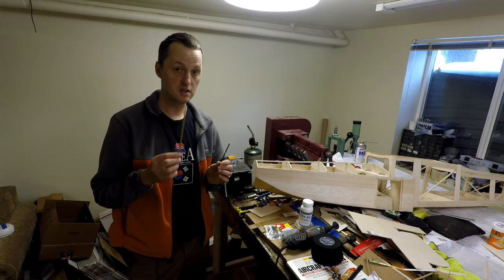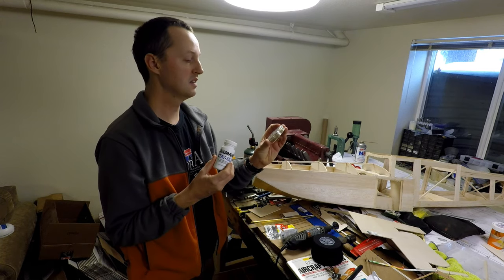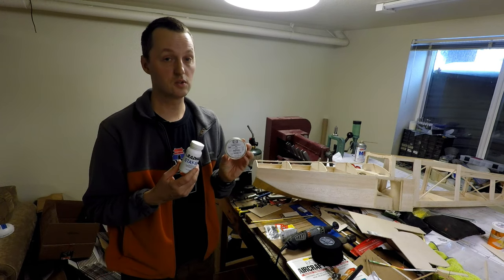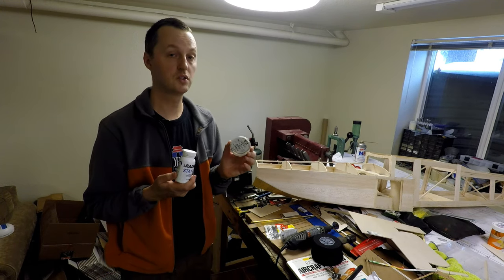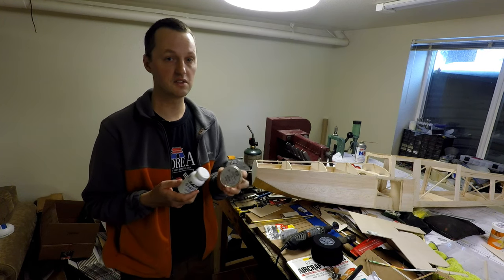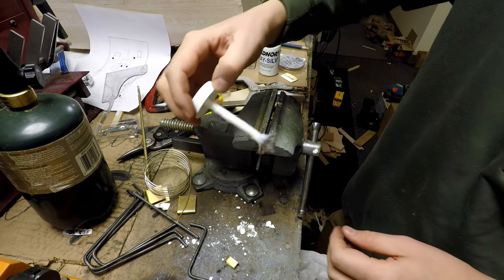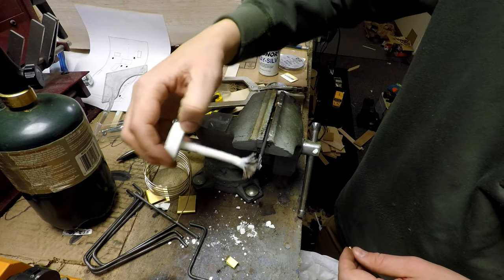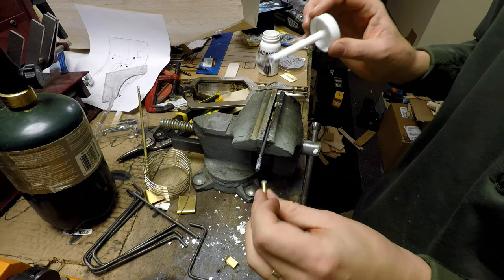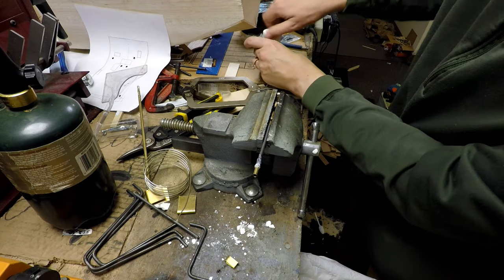To bond the steel and brass parts together, I'm using white brazing flux and a 56% silver brazing alloy. You won't find these at a hobby shop or hardware store — you'll need to go to a welding supply store. I'll put a link in the description so you know exactly what to get. I've already clamped the rod in the vise, spread the flux on, and try to get some inside the brass spacer tube. I'm only putting the tube on just a little bit — I'll show you why in a second.